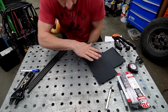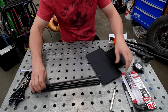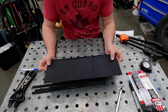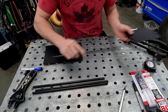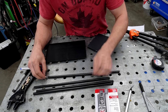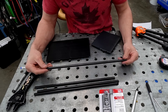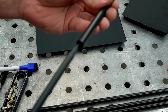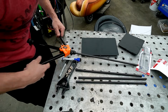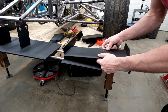We've got four carbon rods here that are going to go through the upper element and sandwich everything together, and then obviously we're gonna put fiberglass or whatever on top for the rods themselves. They have no threading in them, so I'm going to take some rivet nuts, use JB Weld epoxy, epoxy the rivet nuts in there, and also squeeze the rivet nuts in there to really hold the rod. I think I'm just gonna epoxy inside the tubes - swirl it everywhere and put these in while they're snug so they don't crack the carbon. It's a really by-feel thing going on here.